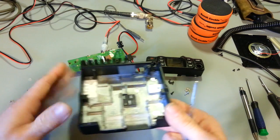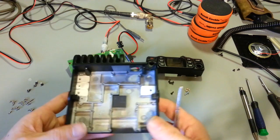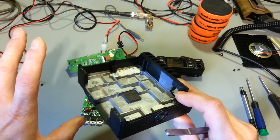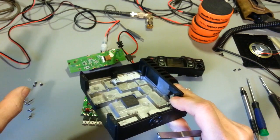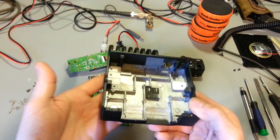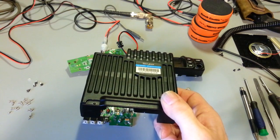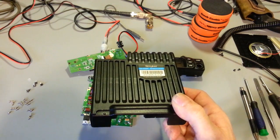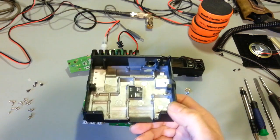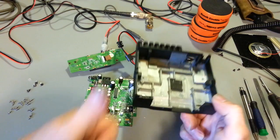This thing does run warm with absolutely no transmitting. You plug it in, turn it on, and let it on for any considerable amount of time, it does get warm. The advantage here is something I've hated about other export radios - where do they always put the heatsink? Bottom of the radio. This radio is not like that. That is the top of the radio. Somebody finally realized heat rises. They did it right - the heatsink faces up. Thumbs up there.